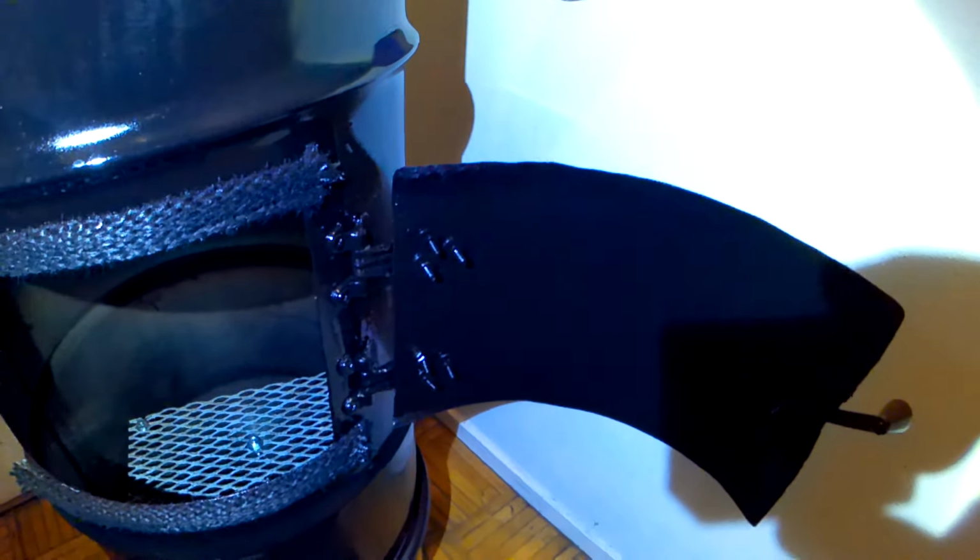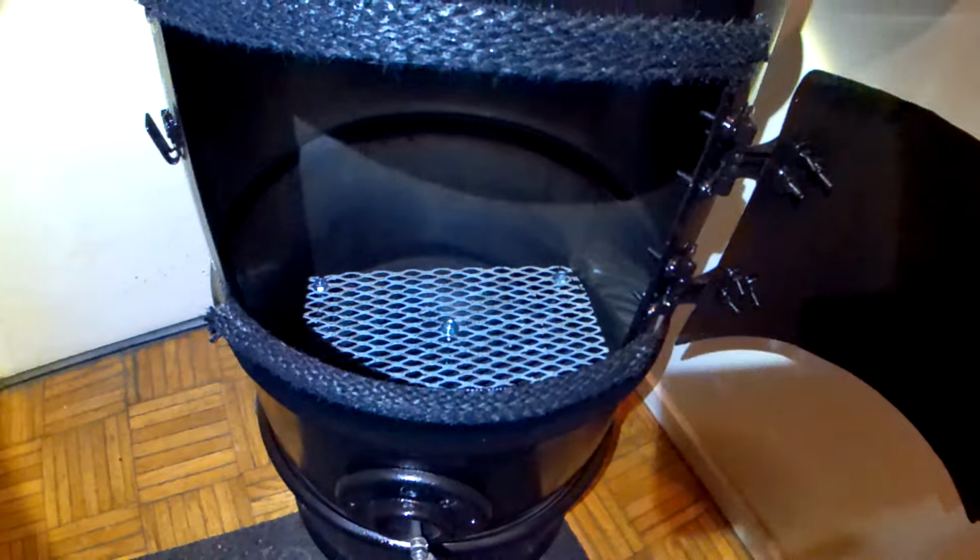We'll go into my hatch. This is just old cabinet hinges, and I got some cable on both sides, so no leaking. Homemade strap hinge. All the recycled parts. Nice and smooth there. And it's a little dark in here right now. Let me get my light and I'll show you. There you go. And there's my under fire grate. Now I'm going to show you how I made that. So I just took heavy steel grating, 5 bolts, so that's nice and substantial to hold some weight, and that'll keep my wood off the bottom of the unit, and I'll have really good airflow.